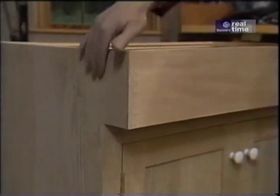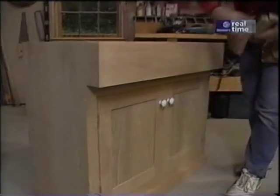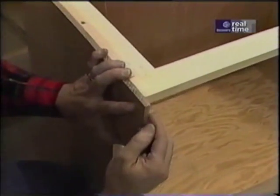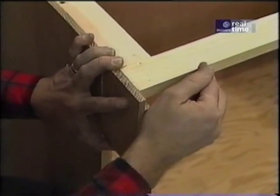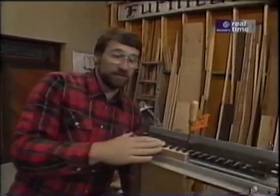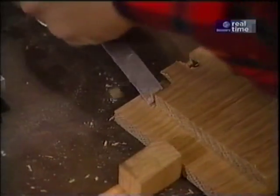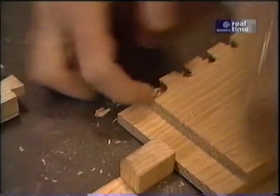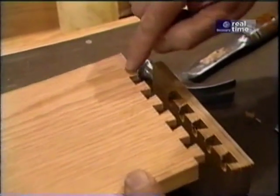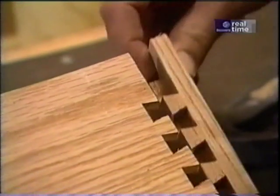Now I need to build this projection of our dry sink and make the dovetail joints. To do that I start out by making a couple little pieces which will fit on the sides, and they've been rabbeted to fit over the top frame. I've taken the left-hand one and the front piece and set it up in my dovetailing jig. Now you'll notice that when I made the front piece here, I didn't dovetail all the way to the top of it, and that's so that when it's assembled this rabbeted joint doesn't show through.